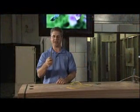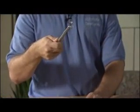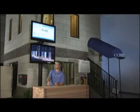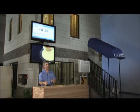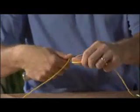I have here a 10-millimeter diameter mandrel, which is a very common thing in the fiber industry. I'm going to take the drop cable with standard fiber and put a single turn around it. You can see what has happened to the loss and to the signal on the video feed — a considerable amount of loss just with a single turn, and you can already begin to see significant signal degradation.